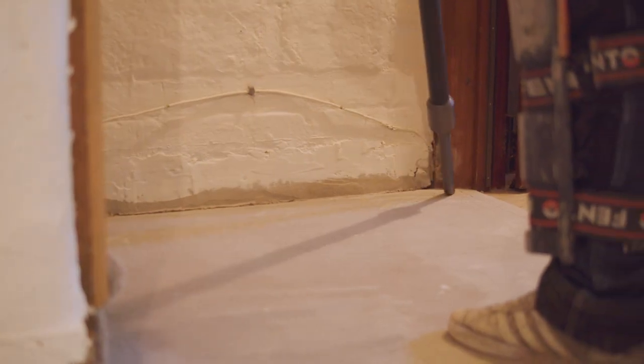After that, we put a final smoothing layer. The reason we do that is to protect the DPM and we also want an absorbent layer for our adhesive to bite into. After that, because there's been a few days that have passed, the area has been trafficked and as well it's been contaminated. So we've come in this morning and cleaned the floor. So by doing that, we now need to feather finish over it to give a nice smooth layer again,